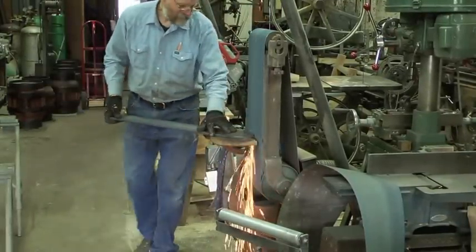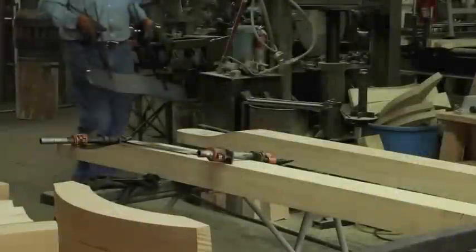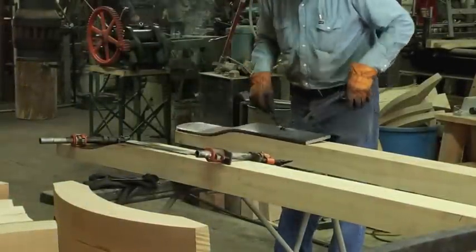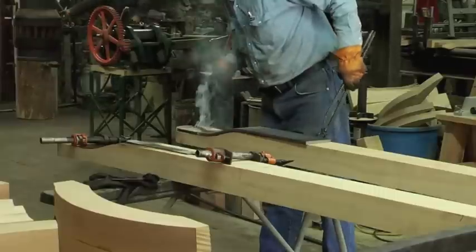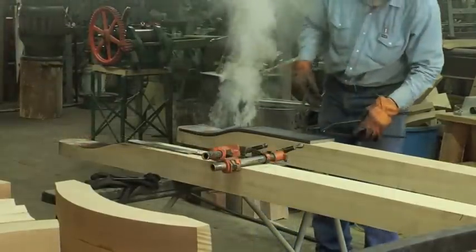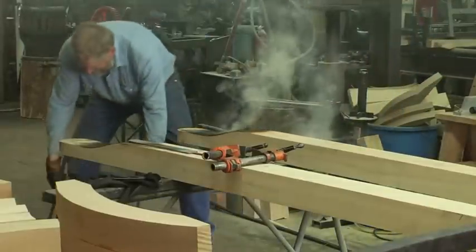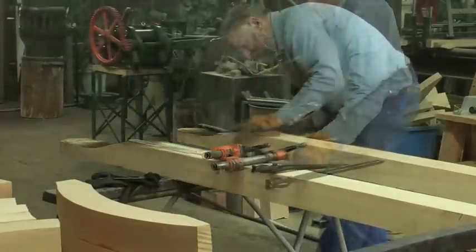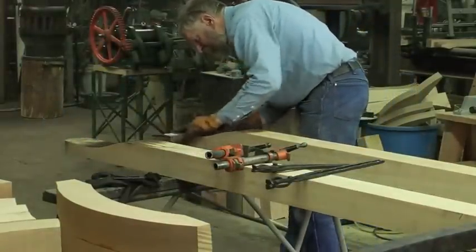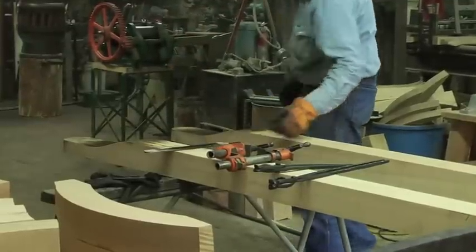The reach itself is four inches thick but it tapers to two inches at the end where the king pin is and where it attaches to the front axle. Where it is tapered, we take this half by five iron and shape it to the curve of the reach, then we heated it up to hot-set it onto the reach. This burns off the high spots and allows us to file them off, giving a good honest fit when we go to bolt these two together.